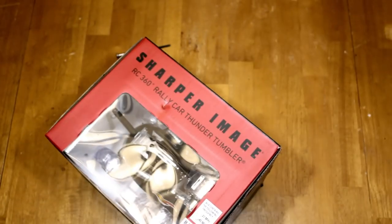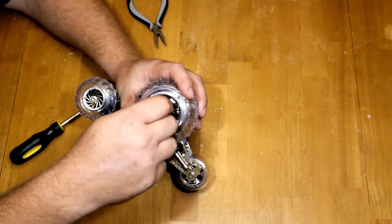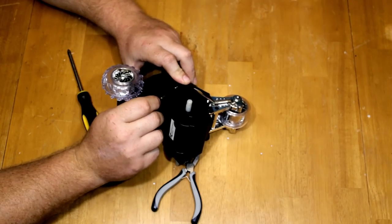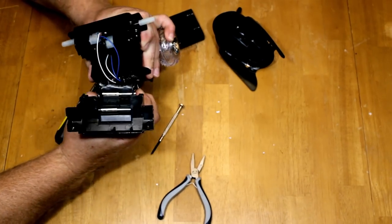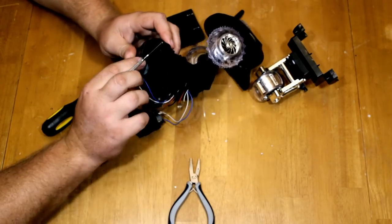That receiver is mounted onto the faceplate in the perforated holes. It's using a very cheap ESC from eBay that goes from 4 to 8 volts for a brushed motor. You need a brushed motor ESC because we're using a brushed motor out of an RC car from your local big-box store. You can find the Sharper Image Tumbler — it's kind of a gimmicky little car, but it has two of these motors in it and they're $9–$10. You take that apart and get two geared DC motors from one vehicle. That ESC pumping out up to 8 volts seems to work really well.